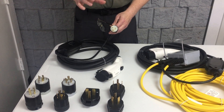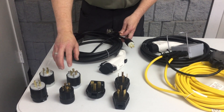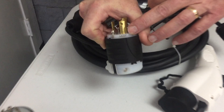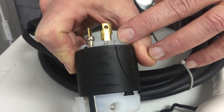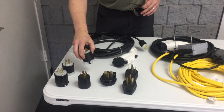Now if you already have a 240 volt receptacle in your home, they're going to be stamped. The receptacles always are going to have some kind of numbering or lettering on it. Like this one here — you can see it says L6-30P. The receptacles are always going to have an R for receptacle; the P means plug.